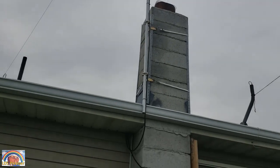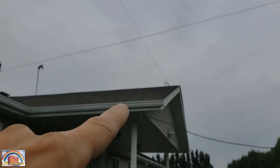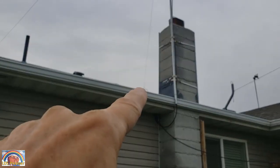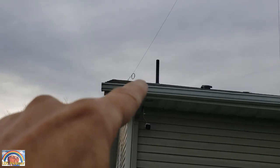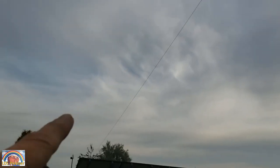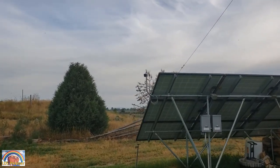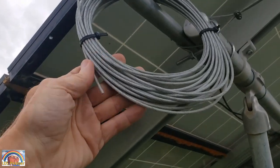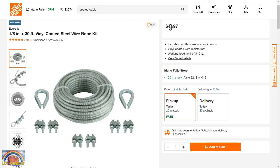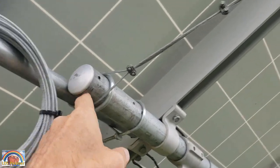I also have four guy wires coming off because when you're that far up and we get 66 mile-an-hour winds, you want stability. I put them as far apart as possible — one over there, one right here, one over here. I used to have one coming down into this corner, but it was too close so I changed it. That guy wire now comes all the way over and attaches to my solar panels, giving me a really nice broad base. It was very affordable. I bought all these items locally. Here's the extra unused cable I just tied up, with clamps to hold it in place, and it's been doing really well.